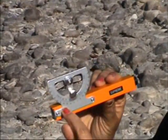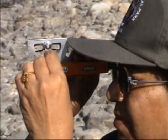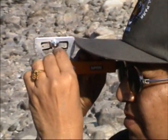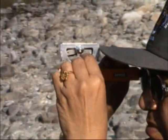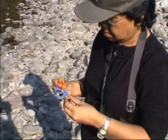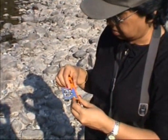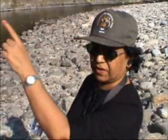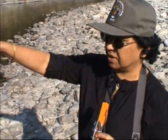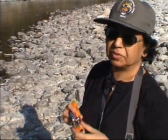Whatever angle comes here is going to be the angle of the slope on the other side. This is about five degrees from where I am standing — that means from my eye level it is five degrees higher up. And now since we have measured the distance, once we have the distance and the angle we know exactly what height it is going to be.